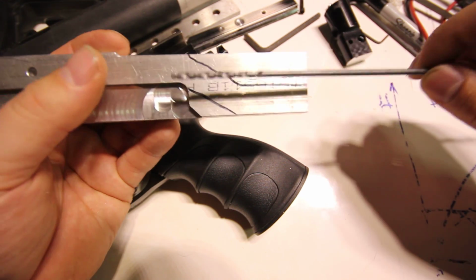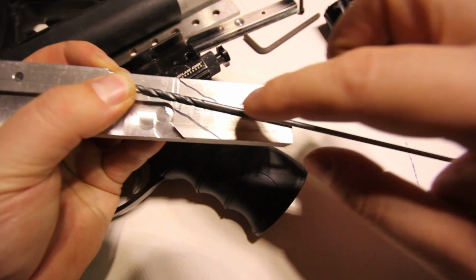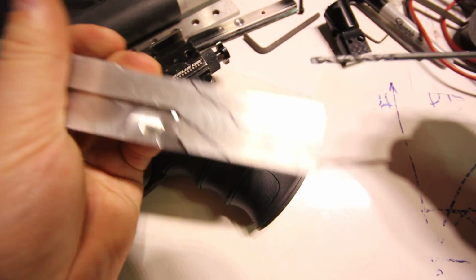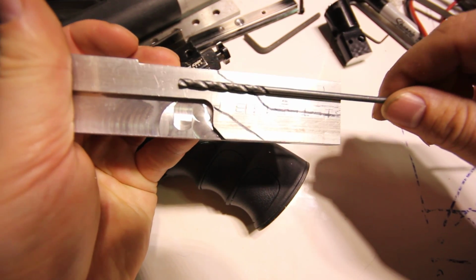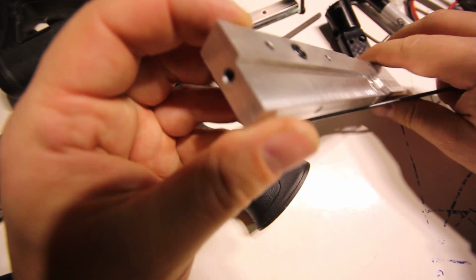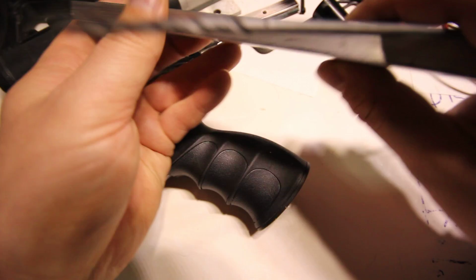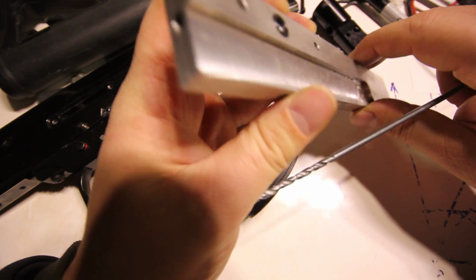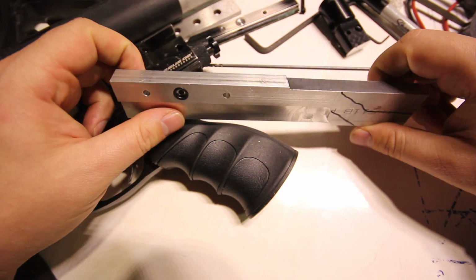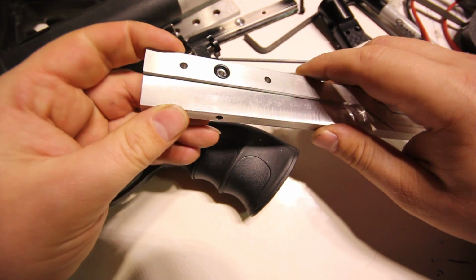So with a drill, the shavings would fill up the channels in the drill bit, and because there is no extraction all the way down the shaft, I would have to pull it out, brush it off, put it back in, drill another 1/4 inch, and just do this the full length of this bar. This took about 40 minutes to do, and I did it without any machinery. You can see it came in center, came out center, which is pretty impressive considering this is a flexible bit.